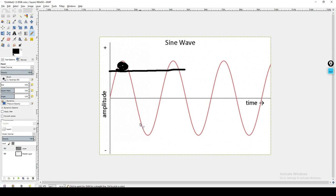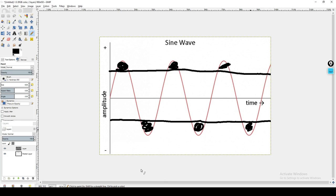And then the rest of the signal, and again, there's also a negative portion over here. So when it comes back down, it hits this point, and this gets chopped off and sent to ground, and so on and so forth. Chops off that peak, sends it to ground. On and on we go. And so instead of your sine wave going up to this point, it reaches that forward voltage point and gets chopped off, and it gets sent to ground.